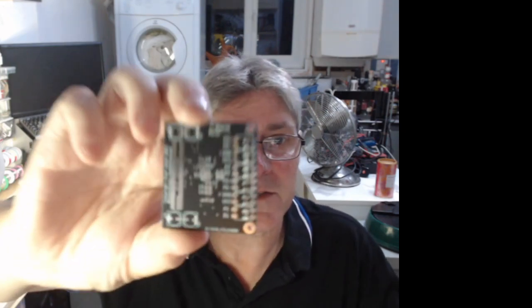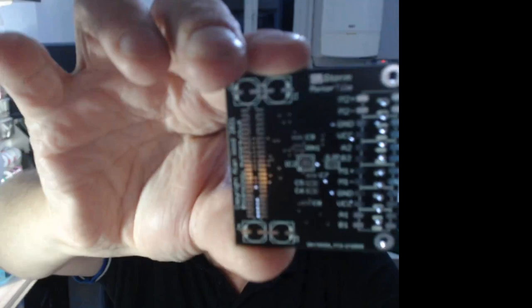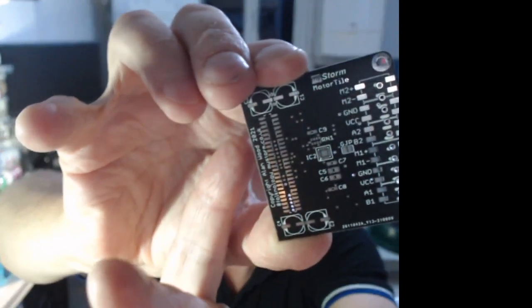I have to be very careful about choosing the aluminium caps on this side here, to make sure that they're less than 6mm, so like a 5.4mm height, 5.5 maybe. Well, I get pushing 5.6. You have to be a bit careful. And I've actually had problems getting hold of those. Again, those are going to come from Asia. So that's delaying me a bit more doing the build up.